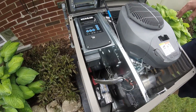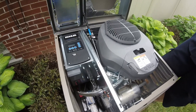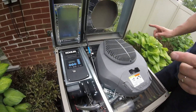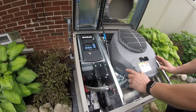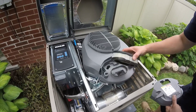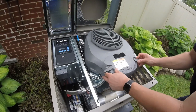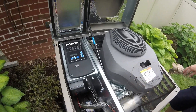The first three years it's just going to be oil changes — annual, or if you get 150 hours of operation, whichever comes first. By year three you'll want to change the battery and the spark plugs; that's all in the manual. This is the air filter — check it about once a year, but honestly we don't have to change them too much. There's not a whole lot of dust around here.